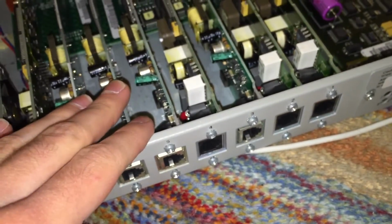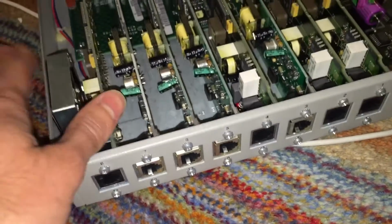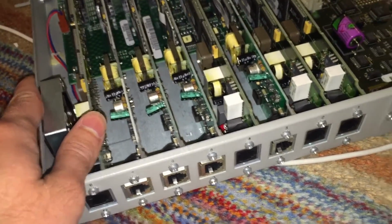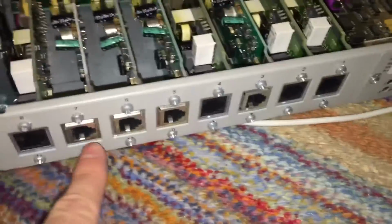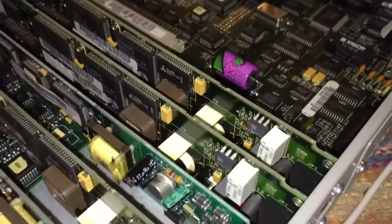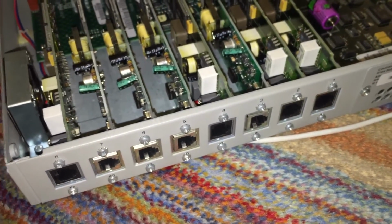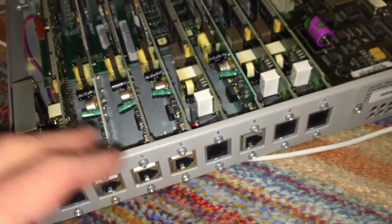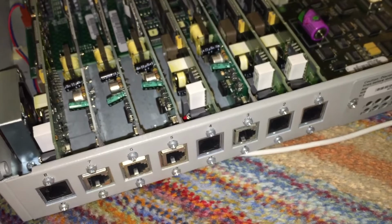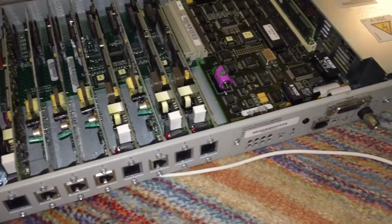Now these actually are different modems. The ones with the black surround, I guess, are the original ones, and they only support V34 standards. However, the ones with the silver surround, which I guess are slightly newer, if you look at them, you can kind of see that the circuitry looks a bit more slimmed down than the old ones. These actually support V90 56K speeds. So, yeah, I don't know why they didn't upgrade all of them to 56K, but I guess they had upgraded this to 56K at some point, I guess for better compatibility. So, that is the inside of the Shiva LanRover E+.